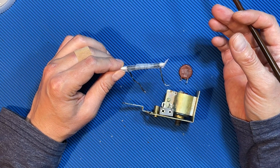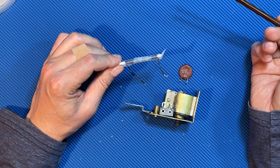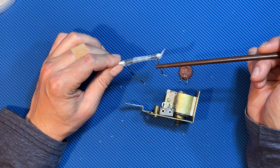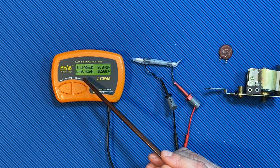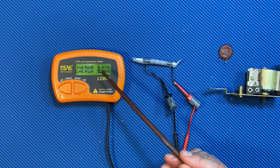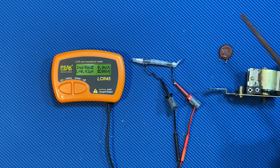I've made a homemade inductor by winding wire around the stick of an old Q-tip. The more windings, the more inductance; fewer windings, the less inductance. By experimenting I was able to find a value that closely matches the 0.47 microhenrys we're trying to replace. On the meter you can see my little inductor is coming in at about 0.42–0.43 microhenrys — very close to the 0.47 microhenrys we need. I'm going to give the homemade inductor a try, and I'll encapsulate the coil in some heat shrink for a more permanent solution.